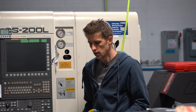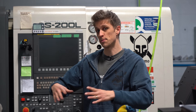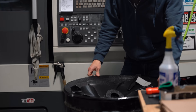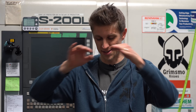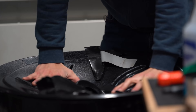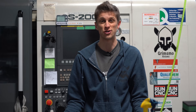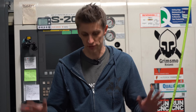I'm a huge fan of the Oneida Dust Deputy, but it's too small and the ports are too small and they tend to get full of chips. So to dump all the coolant, I wanted a bigger solution. I got this from Lee Valley in Canada - it's a Veritas Cyclone lid. Vacuum in here, water, dust, whatever goes around the outside. Except it's upside down - it's pancaked. Once the guys applied full suction to it with water, the thing just buckled in and wouldn't seal anymore. But once we pushed it down and created a seal, it worked so well. It filled this entire 55 gallons in like two or three minutes. Nothing got into the vacuum until the water was like two inches from the top. It's working really, really well and it's fast.